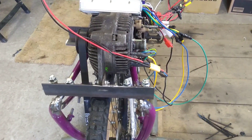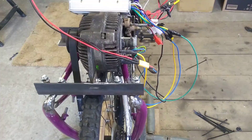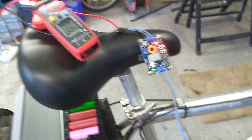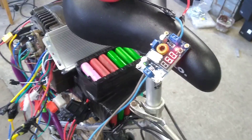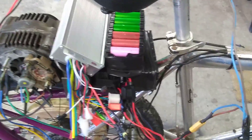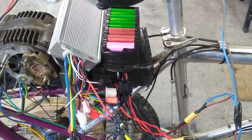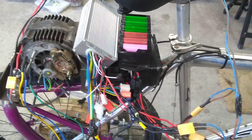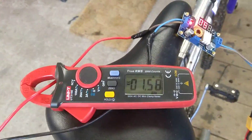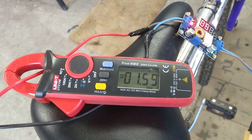But if you thought things were a bit flaky earlier with the external power supply giving 5 volts, yeah it's got worse. This is a little buck converter which is tapped into the most powerful of the three batteries. These are pretty flaky batteries. So that's giving us 5 volts for the armature. Still getting 1.5, 1.6 amps.